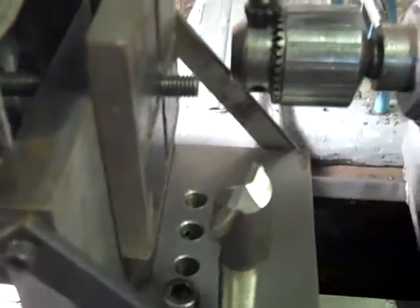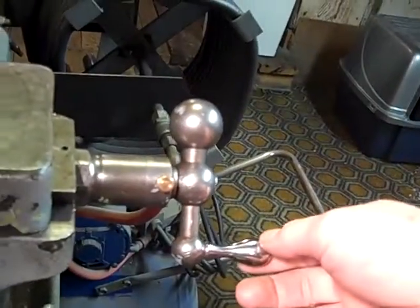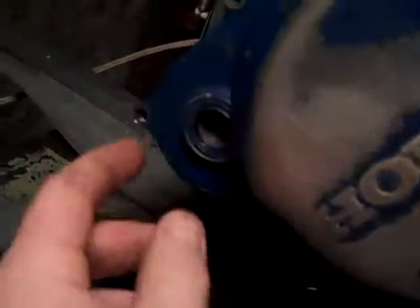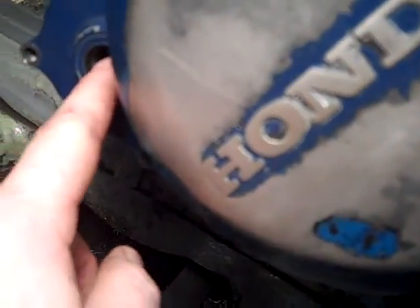If you were wondering, I've got this mounted on the case around an angle plate on the lathe, holding it perpendicular to the spindle. I hold the boring tools in here to adjust the location of the hole front and back using the cross slide. Since I'm only holding it with one bolt, I can spin it to get my up and down, then go back to the cross slide until I've got it indicated and swept to the spindle.